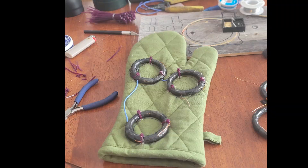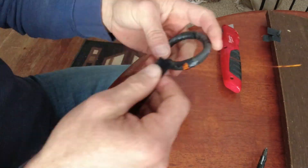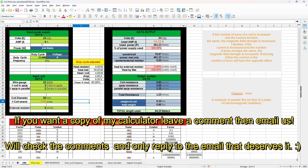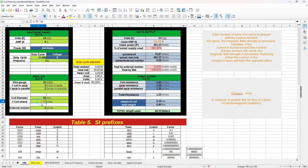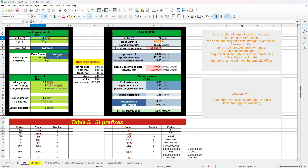I made the coils like we always make the coils around here — if you haven't seen that, watch the previous video. We taped it up like we always do and we did some math. We've got a 24-volt system, 6 amp, 22-gauge, 3 coils in series and 2 series in parallel with each other. Paralleling as much as possible is always the way to do it. We have 100 wraps. I was going to put nothing on the outside but that was never going to work, so I was going to add a 4-ohm resistor, but at 4.57 amps all the heat goes to the resistor.